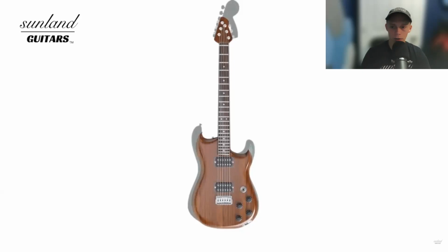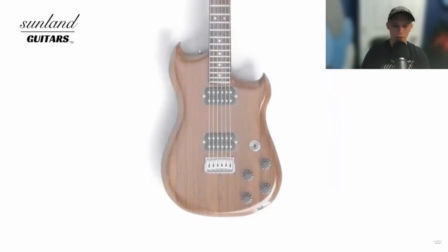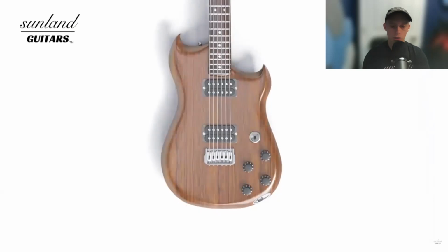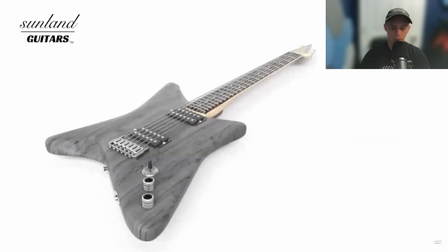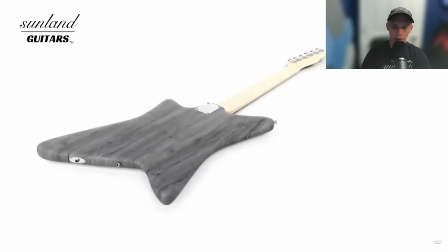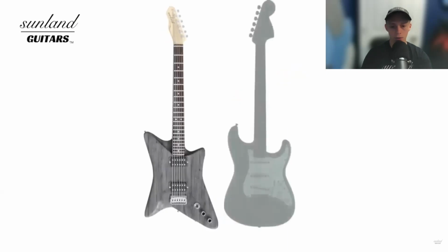And there's so many other ways that we can go about customizing your guitar as far as color goes. So we can do stains, we can do dyes, we can do translucent lacquer, nitro lacquer. I'm willing to do that because nitro is very thin. And we can do bursts, we can do gradients, so many cool things. If you choose an ash body, we can do a cerusse finish. If you don't know what that is, you can look it up on my YouTube channel. I did a black and silver one on a telly. There's so many cool things that aren't used by a lot of builders today.